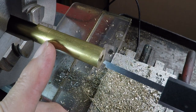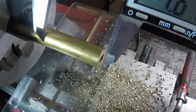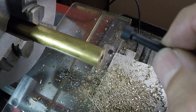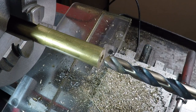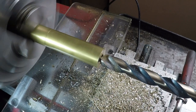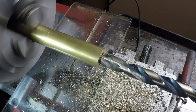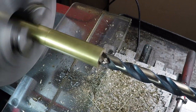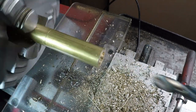I want to make sure I drilled all the way through — using my caliper, that is 1.67, which is quite a bit beyond. Excellent. Now I'm going to bring in a fractional drill so I can bury the head into the end here. One drawback of a very sharp drill bit is it tends to catch on brass — I should have used my cheap Chinese drill — but now I'm in.